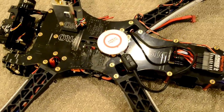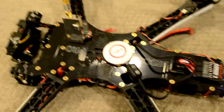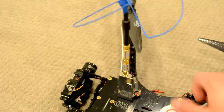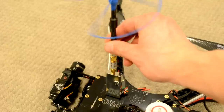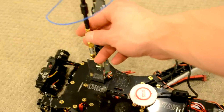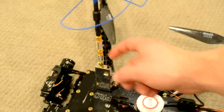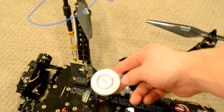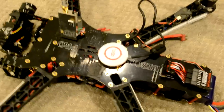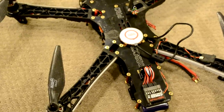I just got back from outside testing out the GPS performance. Long story short, this thing is awesome with the SAW filter in it — it works perfectly. It locked on with my watt-and-a-half 1.3 gigahertz transmitter within about 45 seconds — it's really quite amazing. Even when I removed the low-pass filters I had chained as an easier workaround, I realized there was no other way around it. There's just too much interference that the Naza itself outputs in that same band, so we were going to have to go with a SAW filter, and it worked amazing.